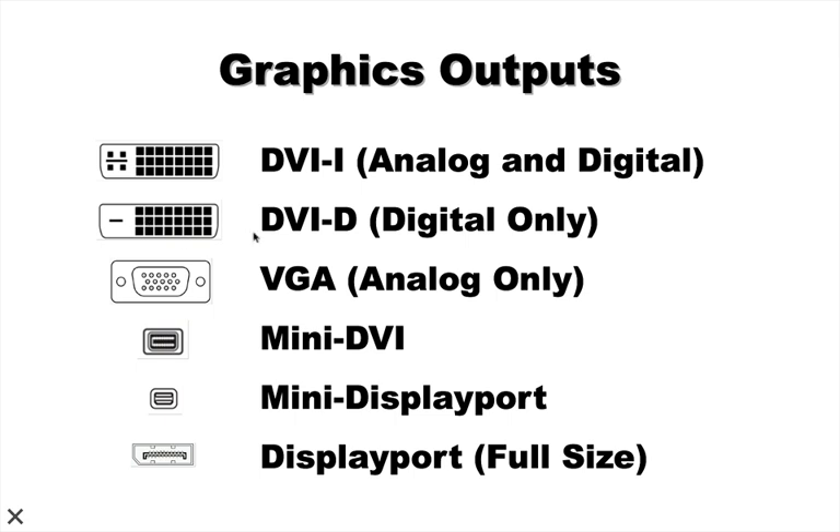The next standard is digital only — that's DVI-D. You'll notice the difference between DVI-I and DVI-D: the DVI-D does not have the four pins located around the little crossbar. That's significant because a lot of cables and devices do not have the ability to carry an analog signal, and some of the Matrox boxes we're going to be speaking of will run into this problem. So you need to be familiar with what DVI-I and DVI-D look like before we get much further.